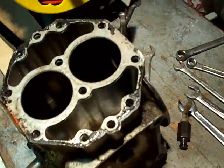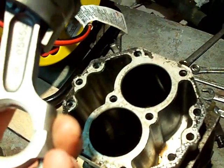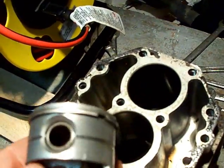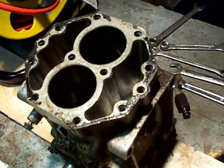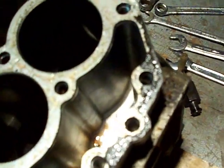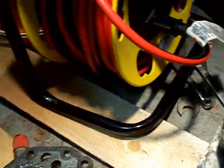They still do pass oil because these pistons — even though they are very nicely made, with what looks like sand-cast aluminum rods with nice 12-point fasteners — only have a single ring. I've actually run one of these without the head and valve plate on, and they do pass oil through the cylinders. It's kind of inevitable. But the nice thing is they don't wear out because I believe they're sleeved. This one has been used for a good long while and there's still cross-hatching in the cylinders.